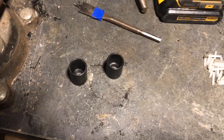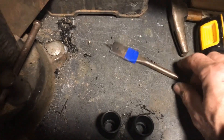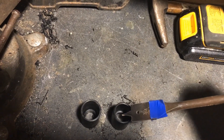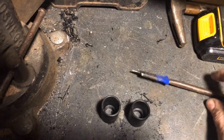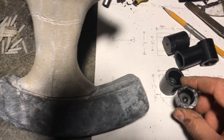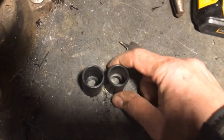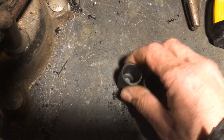I was able to fabricate the inside bushings that go in here, and they actually came out really good surprisingly. There's a little lip on the inside there to retain the needle bearings. The way I pulled this off was to use a three-quarter spade bit — it went in but not all the way, marked with tape — and then a half-inch hole on the other side. A lot of these didn't come out right because they were off-center, but in the end I had to go in there with a rasp and then some sandpaper to get it just the right diameter so that the needle bearings will fit. Happy with the way these came out.